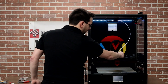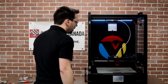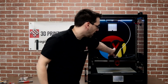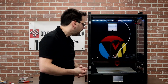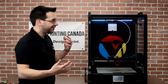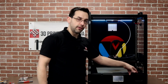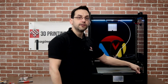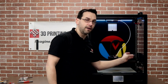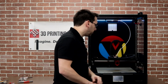The Orbiter extruder at the top has a thumb screw with spring tension adjustment. Pinch it to load or unload filament. It's a dual drive gear — probably Bondtech-style gears grabbing from either side — and it's a geared extruder using a tiny stepper motor on the back, likely a 0.9-degree stepper. I suspect the A and B CoreXY motors are also 0.9-degree steppers. For the Z motors there's no need for 0.9-degree — there's a very high gear ratio of about 13 or 14 to one, so a 1.8-degree stepper gives you far more Z precision than you'll ever need.